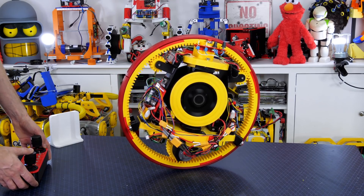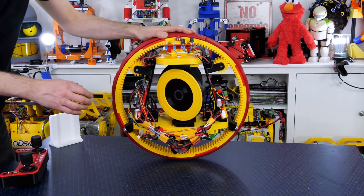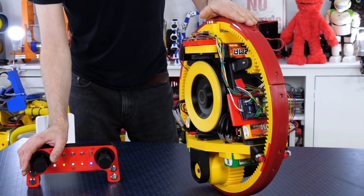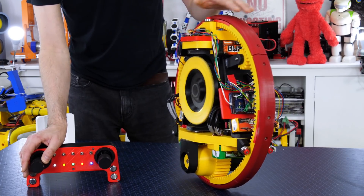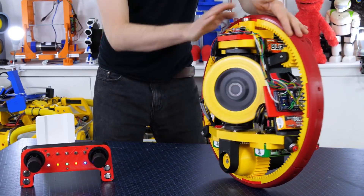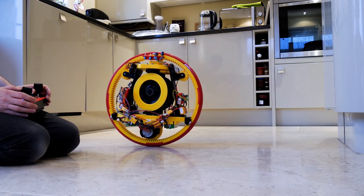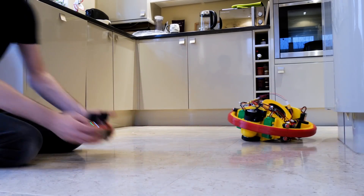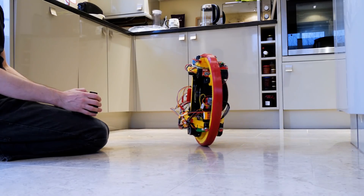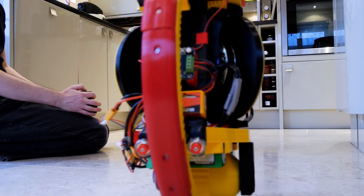There's no encoder on this motor so there's no position hold algorithm, so at the moment it's pretty sketchy. Those gyro motors offsetting their load often cause it to run away depending on which way it's leaning side to side. I've implemented the ability to change the leaning angle side to side with another stick on the controller so you can lean to steer, just like the previous version. It's pretty difficult to drive though because if those gyros ever reach their end stops they can't move any further and it just falls over, so trying to steer just a little bit is actually very difficult without it twisting. The other strange thing is that as I lean to the left it actually steers to the right instead of the direction I'm leaning — I think that's because the gyros are offset from their vertical axis, causing the whole robot to twist and turn unexpectedly.